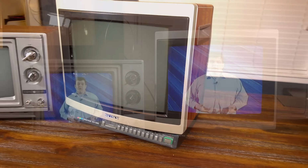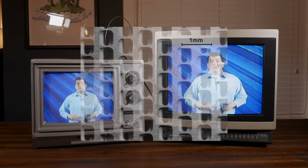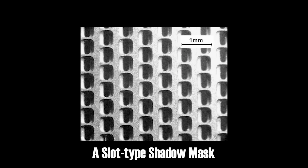The other thing you'll notice when comparing a Trinitron TV to a conventional one is a generally much brighter image. This was the signature big deal of the Trinitron. A shadow mask separates the color components through individual holes in a metal sheet. The earliest CRTs using a shadow mask would lose upwards of 80% of the beam's energy to the mask itself, with only a paltry percentage actually making it through to excite the phosphors and make the screen glow. This was improved over time through the inline guns and the triad phosphor arrangement in the portacolor, but the beam was still blasting its way through tiny slits. This required very powerful electron guns, yet still resulted in a dim picture compared to conventional black and white TVs.